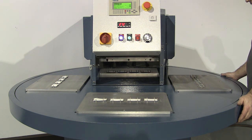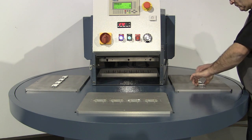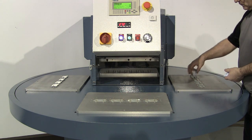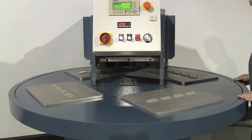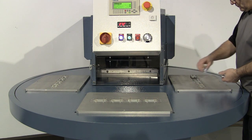An accurate cam drive indexer coupled to an AC frequency drive moves the rotary table. The table speed and time interval at which the table indexes are adjustable to pace the operators who load the blisters, products, and cards and unload sealed packages as they pass the open stations.